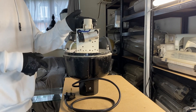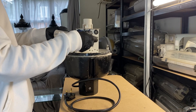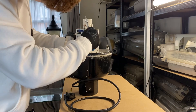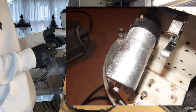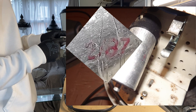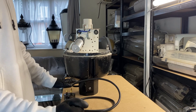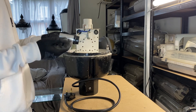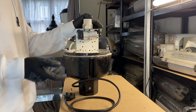This component here is the capacitor — it's an RIC capacitor, held in by a little toggle there which is actually really loose; I'm going to tighten that on. The capacitor is an RIC capacitor, 10 microfarad, and it's got a date code of 287. In the context of capacitors, that likely means the second week of 1987, not February — that will be early to mid January of 1987.